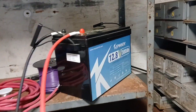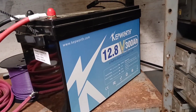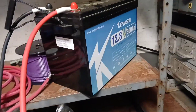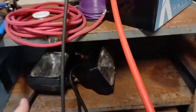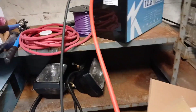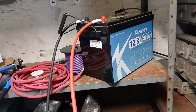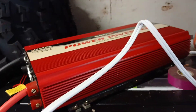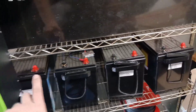I went with lithium iron phosphate batteries — the cheapest ones on eBay, 12.8 volts, $340 a piece. I bought one, ran it, tested it, and recharged it. My makeshift load was about eight amps of halogen bulbs. It ran 40 hours before I decided to shut it off — I got well over 250 amp-hours out of it. I liked the batteries enough that I ordered eight more.